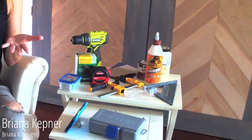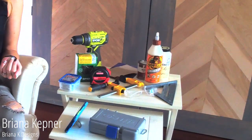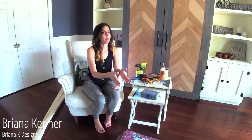And when you are picking out your wood, I didn't want to forget to say this. I think that for me can be one of the most intimidating parts whenever I go to the hardware stores, like getting that perfect piece of wood. Now, the type of lumber we're using will not be perfect. However, don't be shy about pulling down a lot of wood to see what pieces work best for you. They all cost the same, so you might as well get what works best for you. The best thing you can do is place the wood in front of you, looking down it to the floor to see if it has any really strong warping. You want to get the straightest pieces as possible because that will save you a lot of grief later.